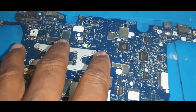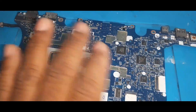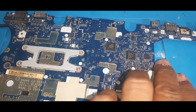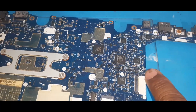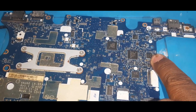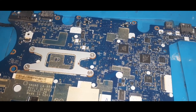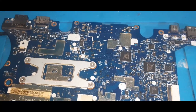This CD3301P IC controls the maximum power section — the first and second MOSFETs and the charging sections. All these functions are handled by this particular IC. The main thing is: once it burns, the motherboard will be in a dead condition. In that case you have to bypass it; until you bypass this IC the motherboard won't turn on. You can check the bypass technique on my channel — search CD3301 and you will get the bypass techniques for multiple motherboard sections.